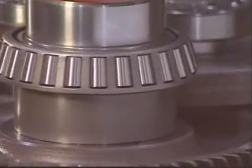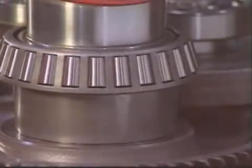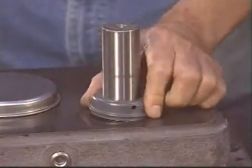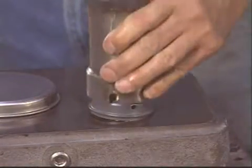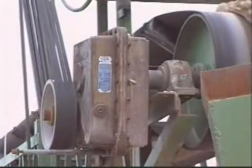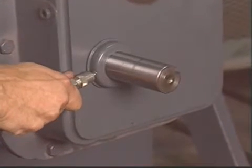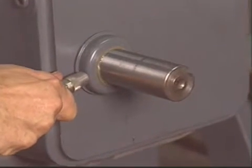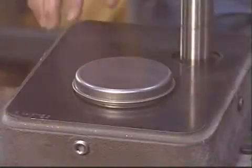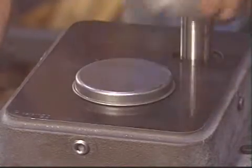Big, heavy-duty bearings provide exceptional load capacity. A severe-duty seal, standard on all Quadrive units at the high-speed shaft, keeps oil in and dirt out. A grease barrier traps contaminants and can be purged when head shaft bearings are greased. And the low-speed shaft is capped to protect the hollow bore.